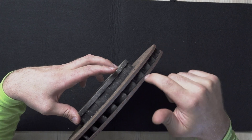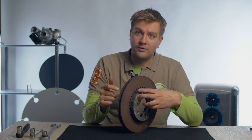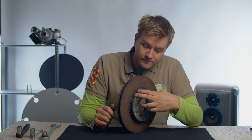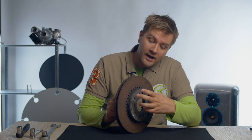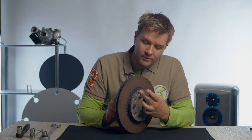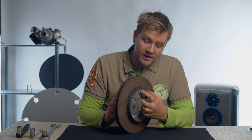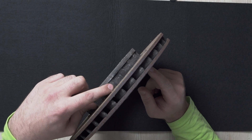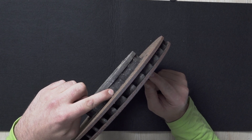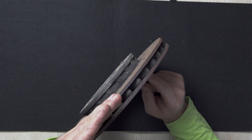The fins are designed to be aerodynamic so air can flow from inside to outside, or from outside to inside, depending on what pattern you want for your brakes. And here I also have aluminum. There are sheet metal parts from aluminum — first a 10 millimeter thick plate of aluminum, and after that a 20 millimeter thick aluminum sheet cut with water cutting to get the correct offset for this brake rotor in the car I tested.